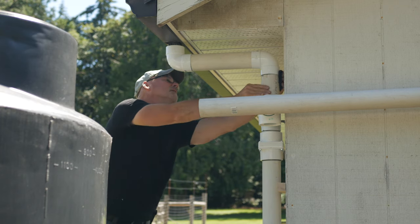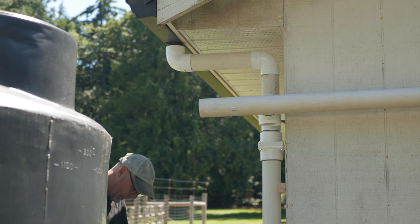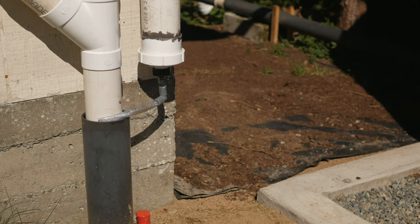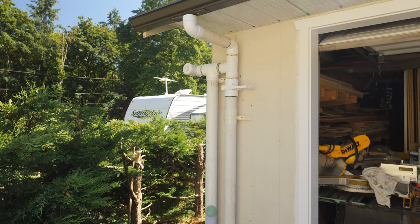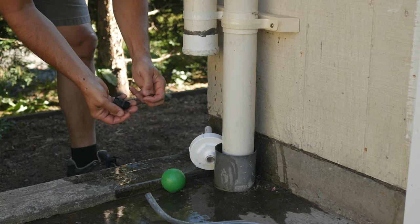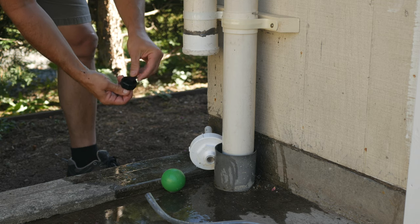After that's in place, I added more straps to hold these pipes to the wall, and glued a section of pipe on the first flush chamber along with the threaded section for the cap and small drain at the bottom. The ball in the chamber rises as it fills with these first few gallons off the roof. It seals off this dirtier first water when it reaches the top. A filter and pinhole washer slowly allow this chamber to empty, but it requires occasional cleaning.